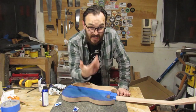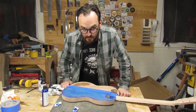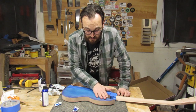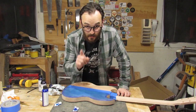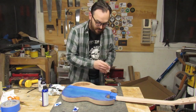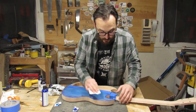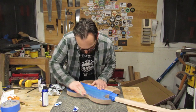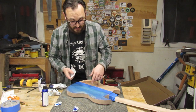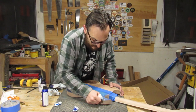One thing I forgot to do — I didn't prepare the wood properly. I was so excited to do this. I'm sorry. My surface is rough now because I put this water-based stain on wood that I sanded to 320, but I forgot to raise the grain and then sand it again. So I'm going to sand it again with 320 — it doesn't have to be a hard sanding, just a light sanding to get those little fuzzies that you brought up with the stain. Also, the first time you put the stain down it will sometimes show you places that still have sand marks because you didn't sand it well enough to begin with. So this is a good time to fix that because I've got to do this dying all over again.